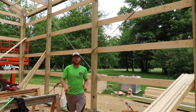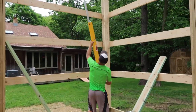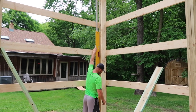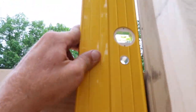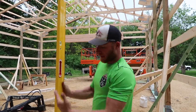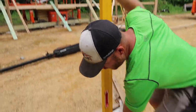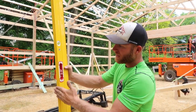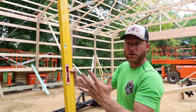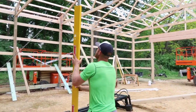The reason I like the plate level from Stabila is that it only contacts at the nubby points at the top and bottom. With a post frame, sometimes your walls might be a little bit uneven - even if it's just an eighth of an inch, it'll hit your level and throw it out of plumb to where maybe you think it should be or really is. By only having contact at the top and bottom it takes out some of the inconsistencies in your wall.